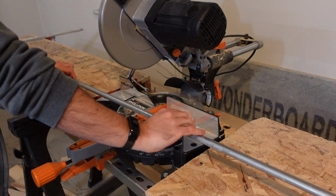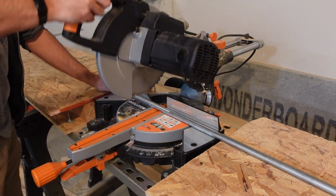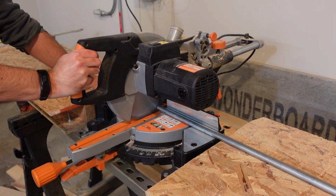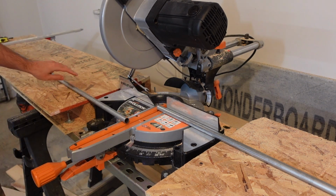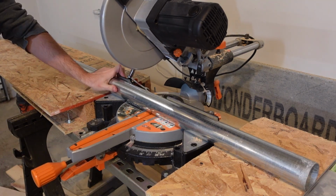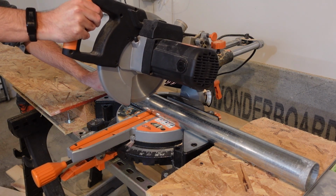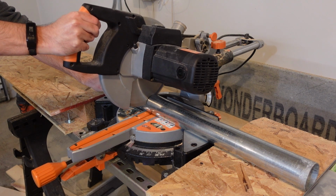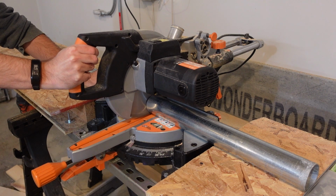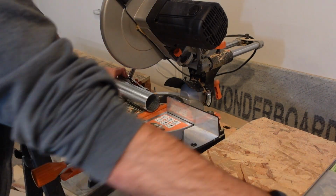The target will be supported off the ground using the half-inch EMT. They come in 10-foot lengths. So grab two 10-foot lengths, cut them in half, and that will supply bases for the 4 targets. The object target itself is made from an 8-foot long 2 and 3/8 diameter chain link fence post. The target zone is specified as 51 centimeters by the PDGA, and we want to be compliant with their target designs.